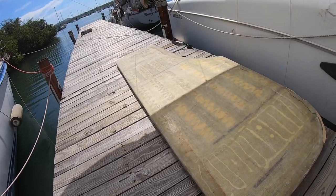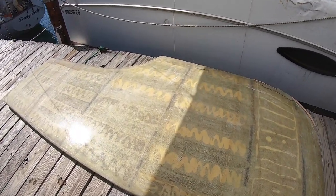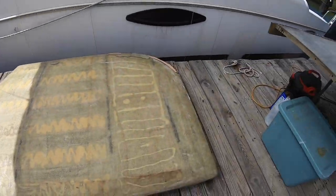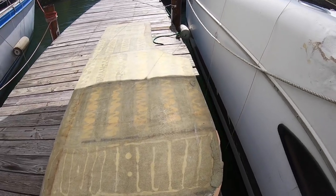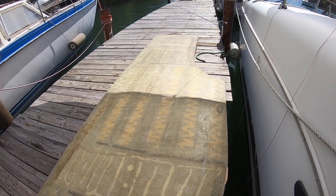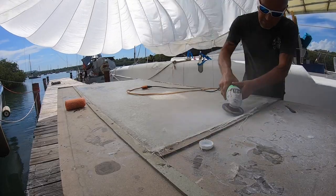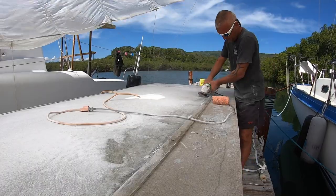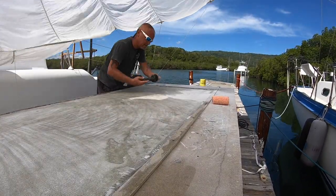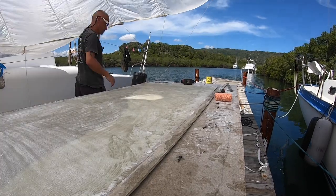After that I'm going to move to this project — our own hardtop — which is what you're probably actually looking for. I'm going to put it on the table. We've got some paint we want to experiment with. I'm going to go around with the sander and clean it up as much as possible, then roll out one layer of paint to see how it sits, how it dries, how it works. That should also give me the chance to see any imperfections so I can sand back and fix them — bare fibreglass is a little bit difficult to see where the imperfections are.